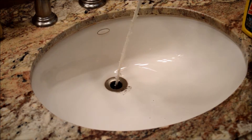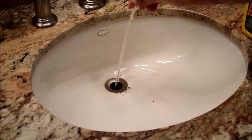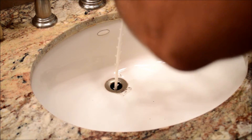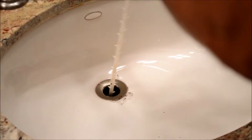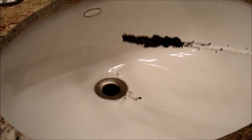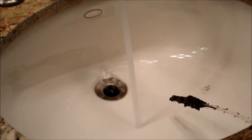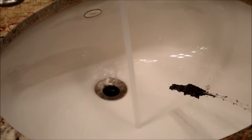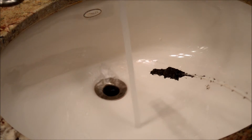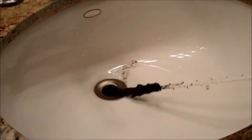Then what you do is go back in and repeat the same process — turning, working it up and down. So basically this will really well unclog your drain. Let's see if there's anything else down in there. That first bunch I brought up might be all that's needed. There's some more — another bunch here. Just by simply doing those two runs down there, the sink's basically unclogged. I'm going to continue doing it to get anything else that's down there, but you can see this works much better.